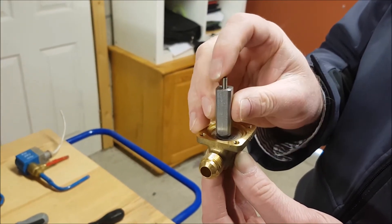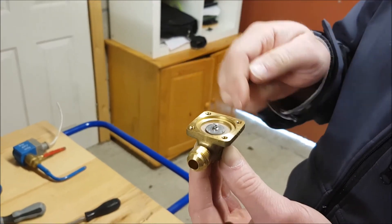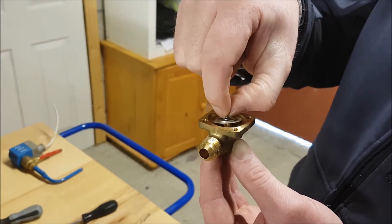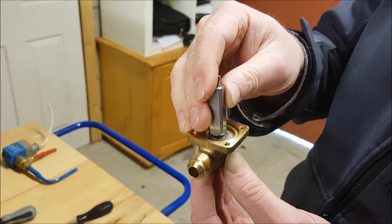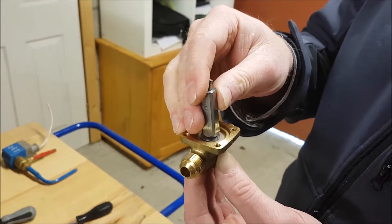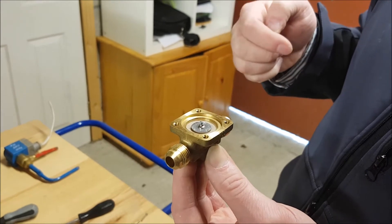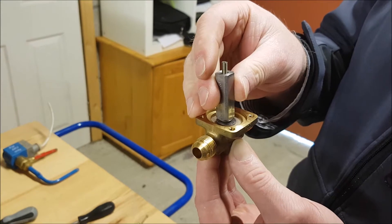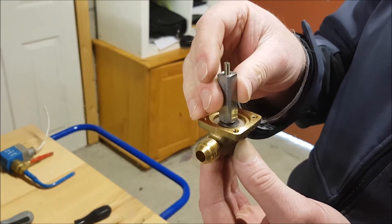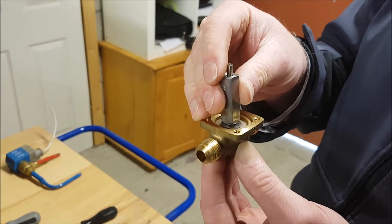The spring pressure will be higher than the liquid refrigerant coming in, so the diaphragm isn't able to lift up or be unseated. It'll stay stuck in position and the refrigerant can't go any further. The refrigerant will stay at the entrance to the valve and back its way up along the liquid line as far as the liquid receiver. So de-energized means the armature stays in position and prevents any refrigerant from continuing its journey through the valve to the exit.